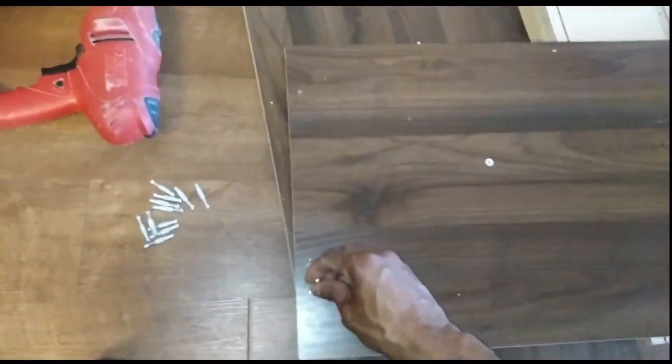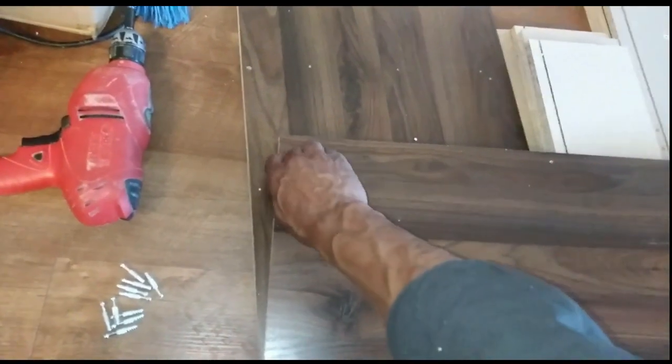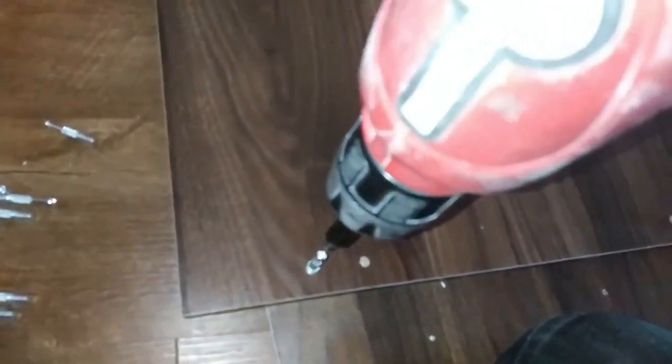I start with the top board, which is the C board — the very top board on the dresser. These bolts are the cam bolts, and they're going to go one to each of the four corners of the board. A quick tip to make it easier: the cam bolt holes are smaller than what's called a wood dowel, or pin — that little piece of wood. The dowel will just slide right into the hole provided for it, while the cam bolts have to be screwed in.